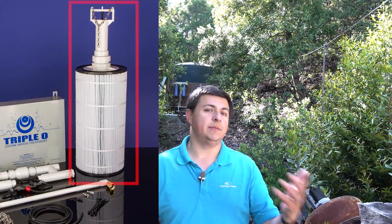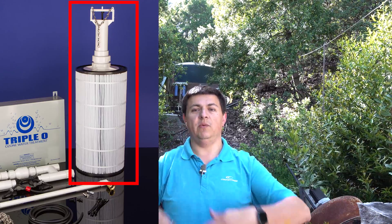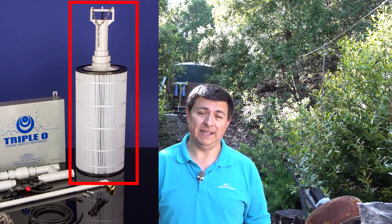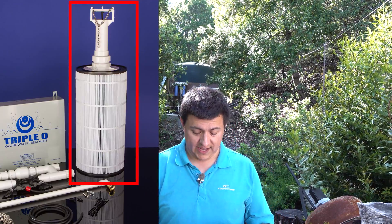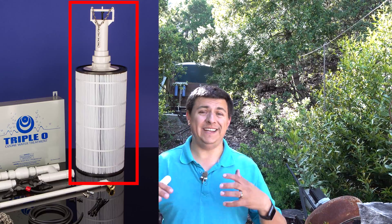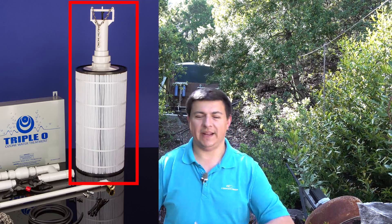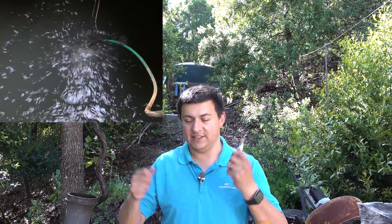Now let's address some questions from our last video. The first relates to in-tank water filters — you've probably seen those from Triple O and similar companies. There's an air stone inside a big filter element that bubbles up through it, theoretically pulling water through the filter and out the top. We don't use one anymore. We bought one initially, and they're a royal pain to maintain. The iron oxide and manganese oxide sticks to everything — that's why I wear gloves near the water tank — and it's hard to get off your skin. All that goop and particulates cake onto the filter, and when you remove it to clean it, everything comes back out into your water.